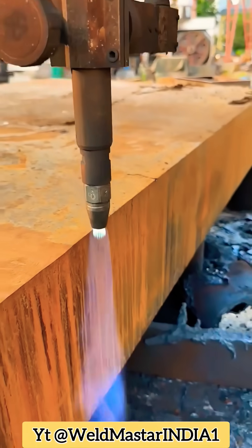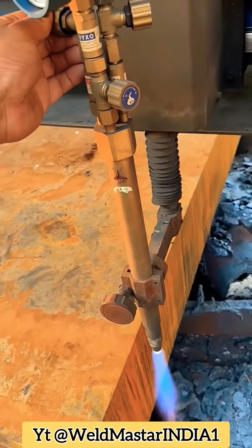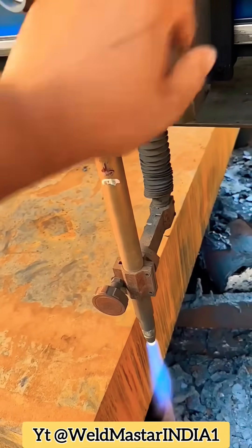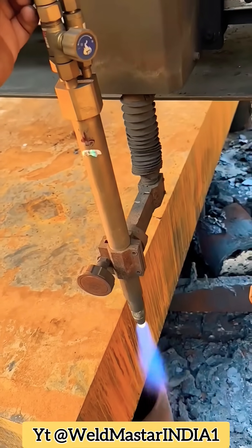We open the cutter and the kerf is very short. To tune the flame you need to increase the oxyfuel flow so the kerf will form properly. That's why the latter part of flame adjustment is tricky — just increasing the cutting oxygen alone won't do it.